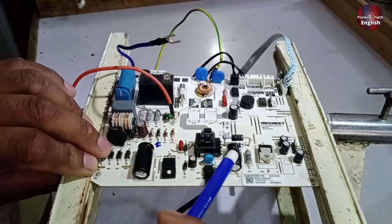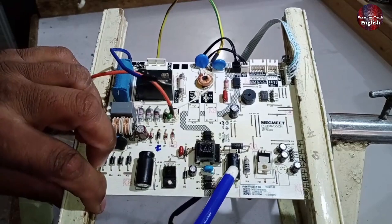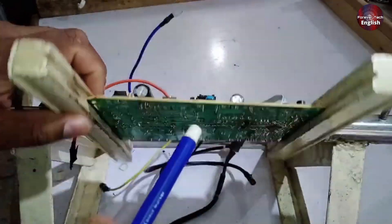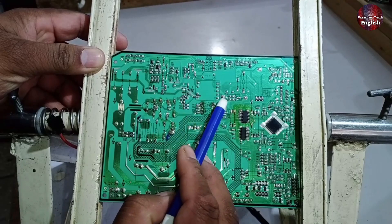Additionally, there's another capacitor installed for filtering — EC3. The chopper generates the voltage here, and this capacitor filters it. It's connected to the ground. If it becomes faulty for any reason, you'll also face disturbances in the voltage.